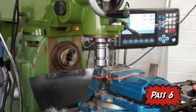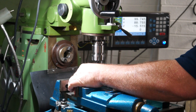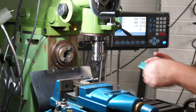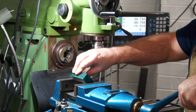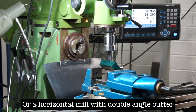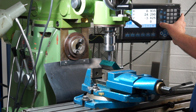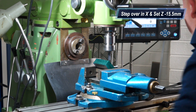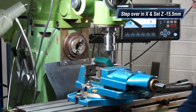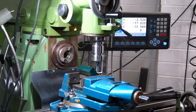Keep in mind the other side has already been dressed. Now let's do the prismatic milling for the jaws. There are many ways you could do this — you could tilt the head, put an angle plate on, etc. I went for a good old-fashioned V-block, though 45-degree V-parallels would also work. Touched off on the top of the cutter and I've used my CAD system to work out my depth of cut. Coming in gently in X to kiss the part, then I'll set X0 and start my cut.